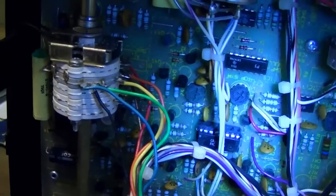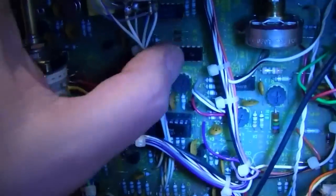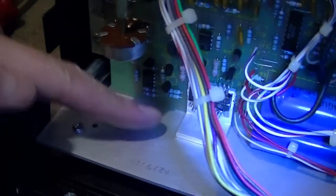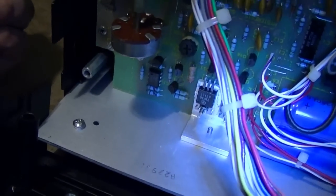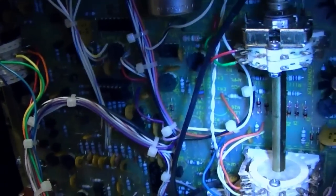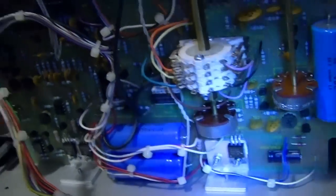And you can see the switches actually mount right onto the circuit board. Kind of a nifty construction technique. All the other parts are readily available. There's our TTL logic chips, some transistor arrays, TIP29, TIP30 power transistors, a bunch of discrete transistors. So if you need to repair any of this stuff, just order up these parts anywhere, no problem.